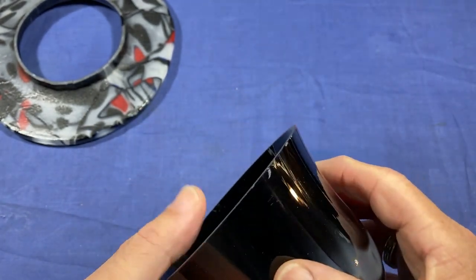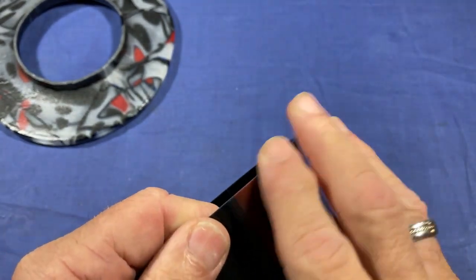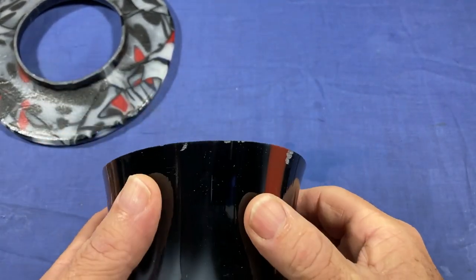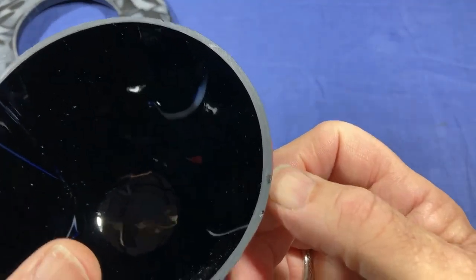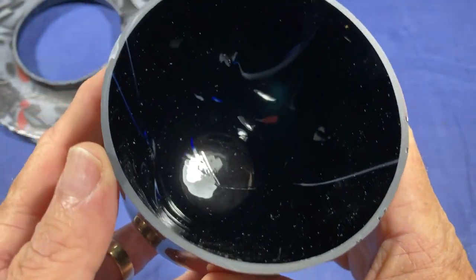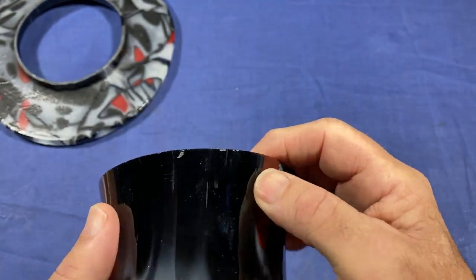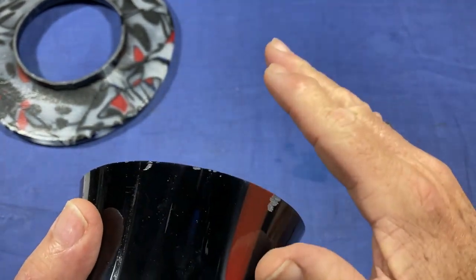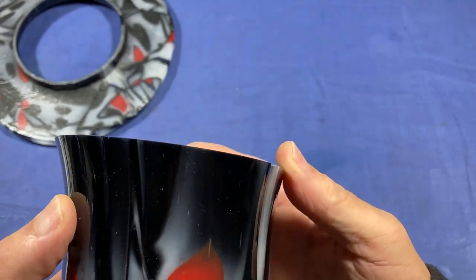The other thing — I tried a diamond pad to just get rid of that edge around there, and it worked fine. But depending on how you do it, if I do it that way, it chips. You can see there — I took a couple of little chips out. Again, I'm not going to grind them out, they're going to be there to remind me forever. So I grinded it at a 45 degree angle — don't do it the other way. That worked a lot better and has given it a nice little beveled edge.